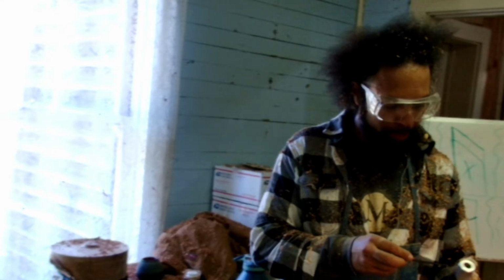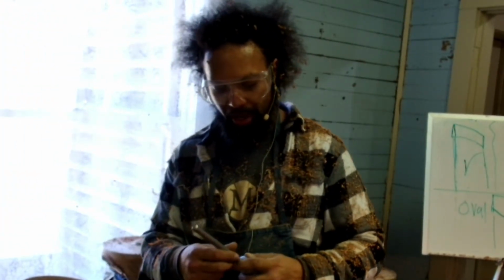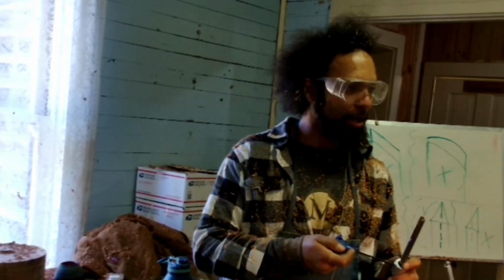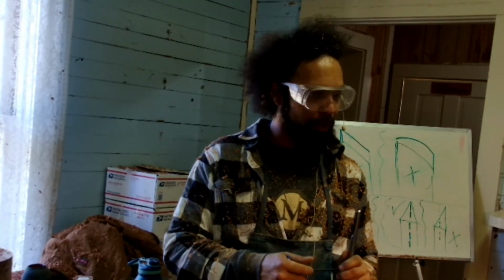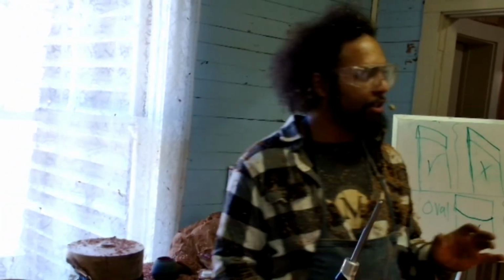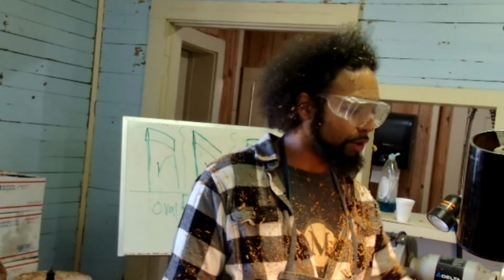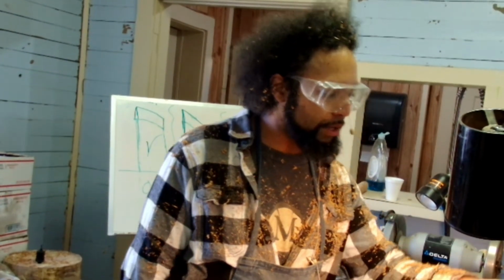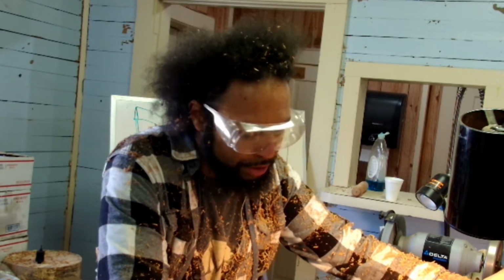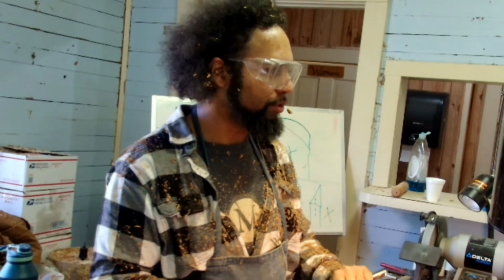I'll add a little disclaimer about carbide and why. Carbide's not bad. It's just that you're not going to get nearly as clean a cut. You're just scraping the whole way, unless you're shear scraping on an exterior. It's good for interior hollowing though. But I have to be careful, because I'm an educator, so I don't want to entirely say it's bad, because there are good applications for it. They're good for hollow forms. Also, people who maybe have a physical limitation, where for some reason, if they're using a gouge, the rotation of it is causing them pain for a condition of some kind.